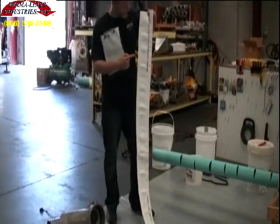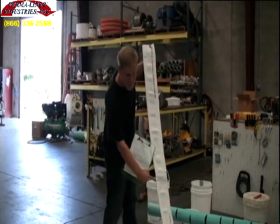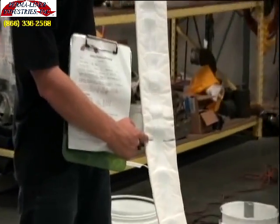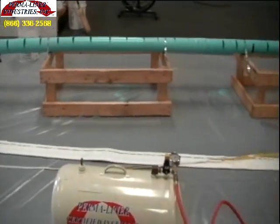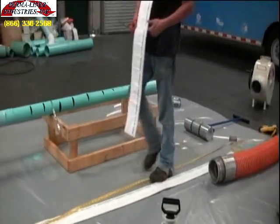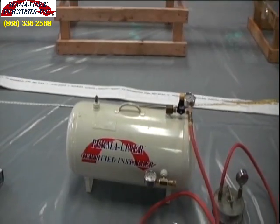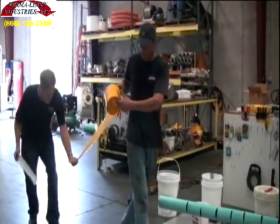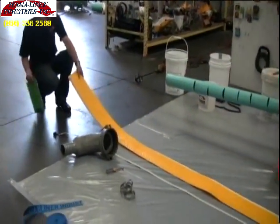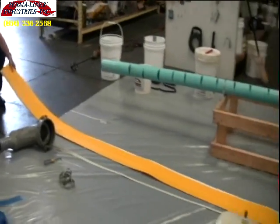As shown, we have marked our four inch cutback along with the amount of dry material. This is the point at which we are going to insert the liner into the pipe. Now we are cutting the calibration tube — it is two feet longer than the lined pipe — to ensure that the bladder keeps past the end of the pipe.